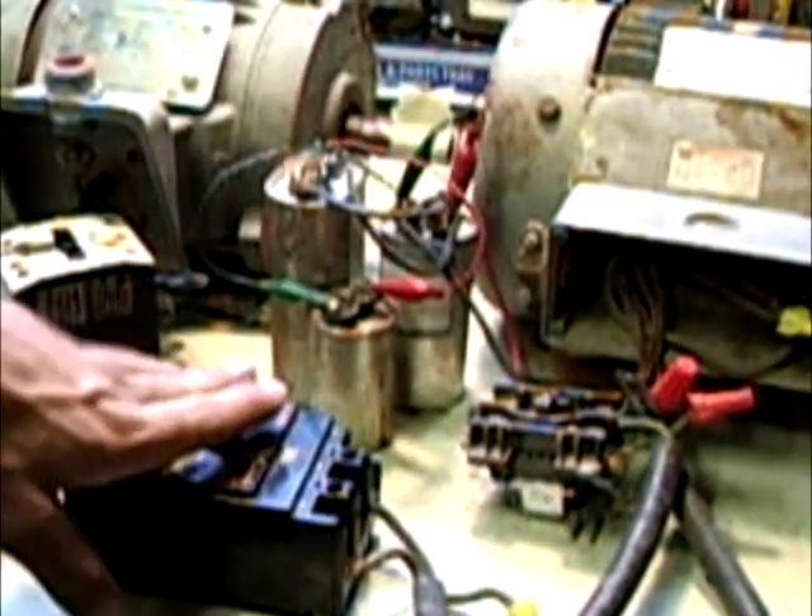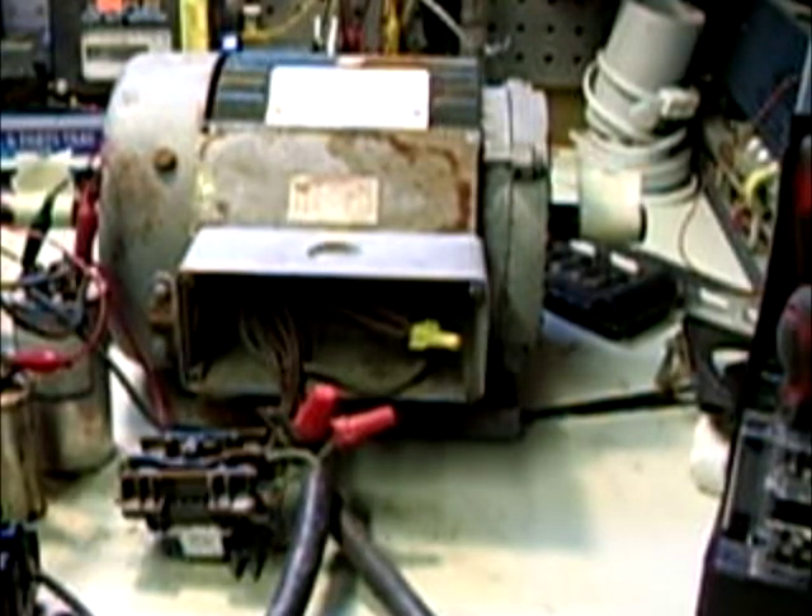How it's going to work: I'm going to turn this on. This momentary contact switch is going to put the capacitors into the circuit temporarily to start the idler motor. Then once everything is running, I'll use this contactor to start the second three-phase motor. Here's what happens when you try to start a three-phase motor without a starting circuit or another motor to start it.